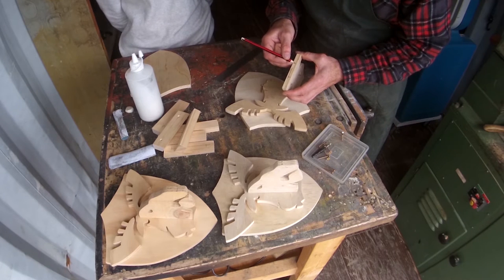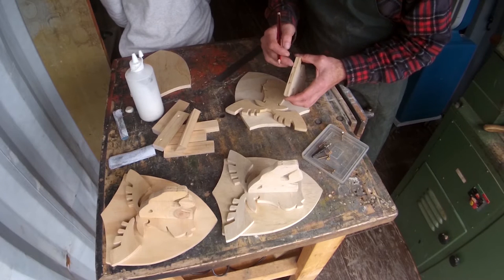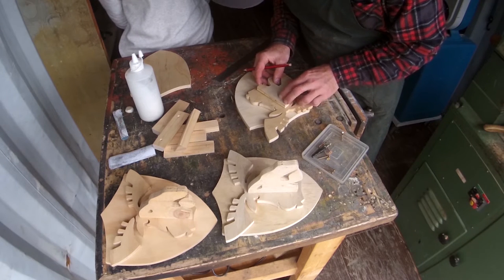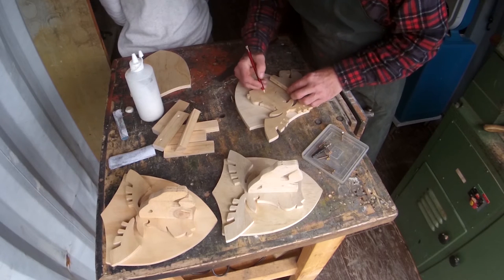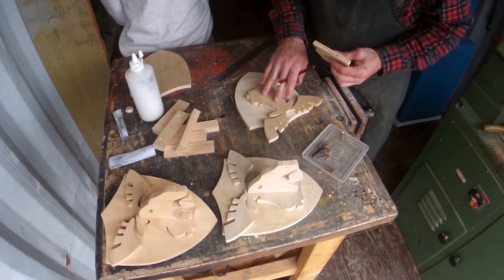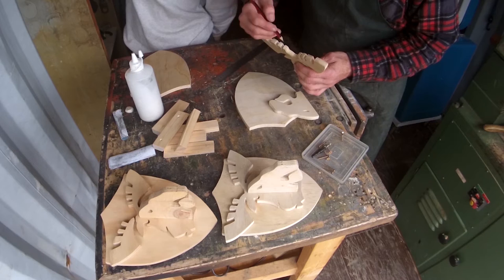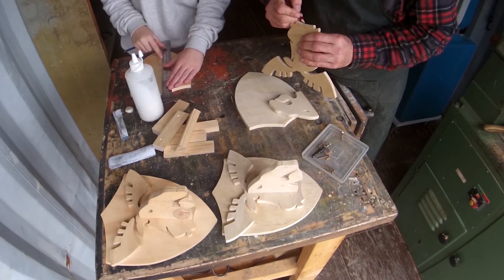This is plywood, so you should see the centerpiece of ply. Want two crosses. Using those, line up your nose so he's in the center. Use those two marks to transfer these across. So that's where I'm going to screw through. They're going to match each other, and then we'll glue it to the front. And add a little line on top so you know where the centers are.